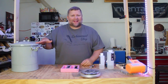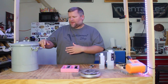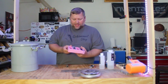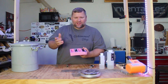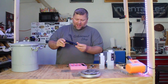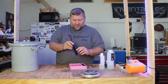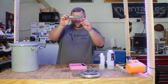I pulled the blanks out of the pot. They sat overnight — I poured them around six last night and pulled them at seven this morning, so they've sat for over 13 hours. They look good. The only issue is my wood floated a little bit, which I didn't think it would — I should have thought about it because it wasn't super tight. The resin went all the way around the blank, but it's still thick enough to make a pen out of. It's probably between an eighth and a quarter dropped down because the wood floated up.